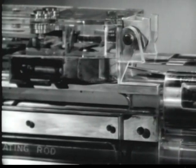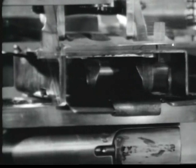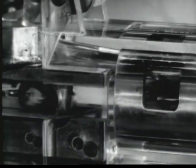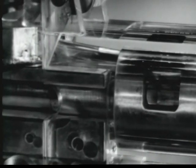The bolt travels forward and the cartridge is stripped from the belt. In the M60, the round is stripped from the belt link in a single forward action by the upper locking lug striking the rim of the cartridge and moving it forward. The link is firmly held by the front and rear cartridge guides and cannot move forward with the cartridge. The nose of the round is guided down into the chamber by the chambering ramps. The bolt locking lugs contact the curved surfaces of the barrel socket, the bolt starts to rotate clockwise, the extractor engages the rim of the cartridge, and chambering is completed.